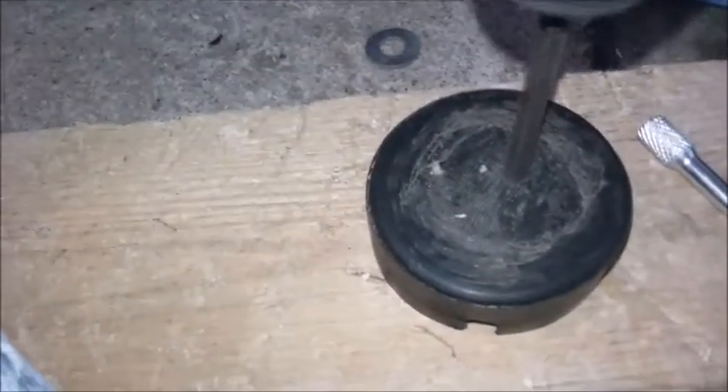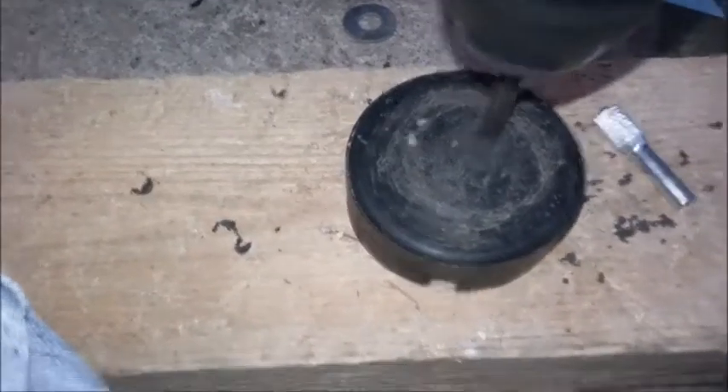These agitators cost about at least £40-60 online. Going back to the hole in the hockey puck — drill it off centre. That's the important part. If you drill it in the centre there won't be any hammer action. Drill it off centre. You can see when the drill bit caught it, it was kind of wobbling like anything.